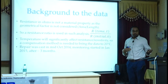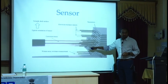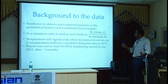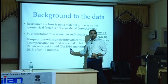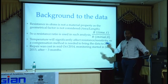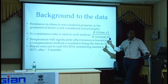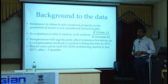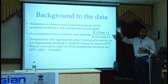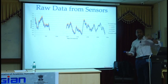We know resistance is strongly correlated to temperature, so we need a temperature compensation function — that is why the temperature sensors exist. Critically, concrete was poured in October 2014, but monitoring only started in January 2015 because we had to wait for the contractor to leave the site before we could complete programming and data logging. So unfortunately the sensors could not capture the early hydration behaviour — a lot would have happened in those first three months — but that is fine since our long-term goal is assessing whether the repair is effective.